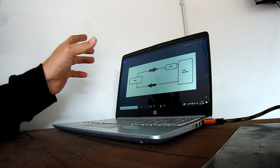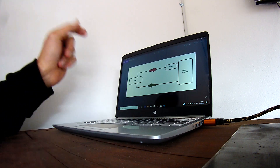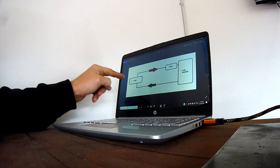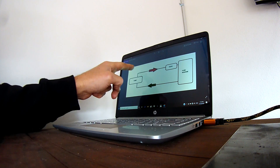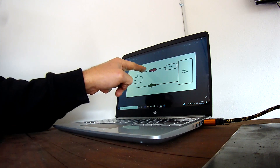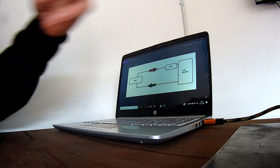After some more Googling, here's what I came up with — a really basic schematic of how our dyno is going to work, with very few parts to keep it simple. Our dyno is going to start with a hydraulic pump, which is run by the motor of the go-kart. All it's doing is rotating hydraulic fluid through a circuit — up out of the pump, past the red arrow, to the fluid reservoir, back down, and back to the pump. Even without adding anything else, that's going to put some load on the engine — it takes some horsepower to move that fluid around.